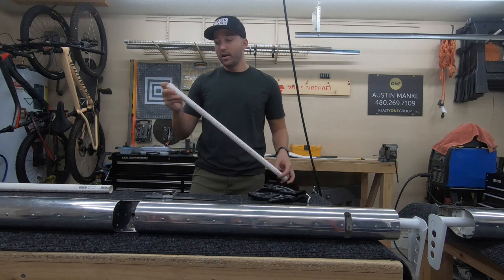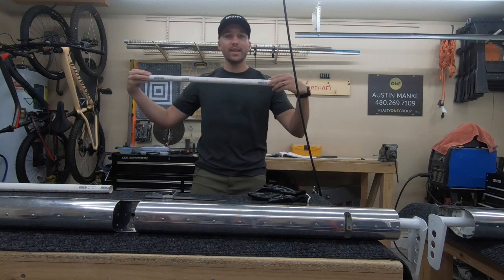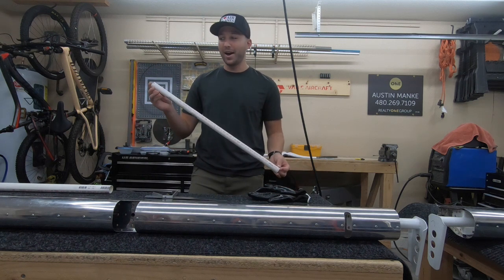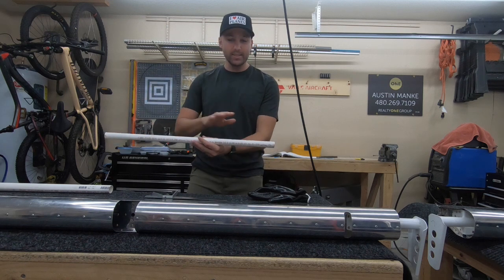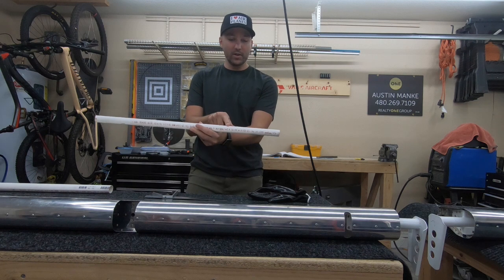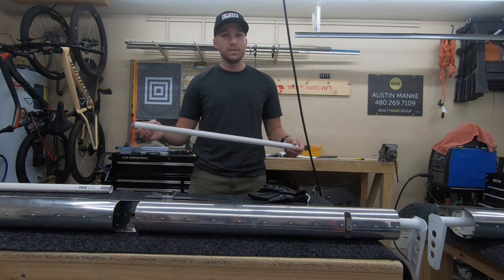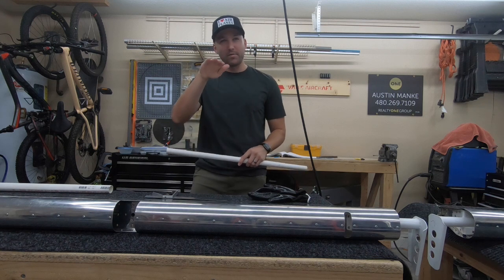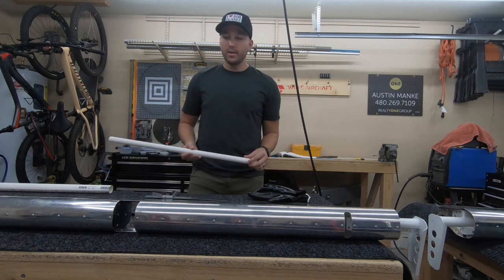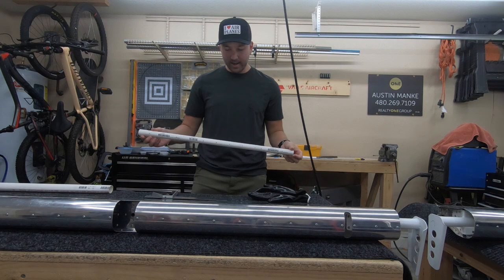I know other people have tried mass-drilling holes and using clicos instead of duct tape. I would not do that personally. What I found was it pulls the material around, but the material between each clico starts to pucker and get deformed, so the sheet metal won't have a consistent edge. The second I saw that I immediately put a stop to it, and I do have a couple of little spots where it puckers out slightly.